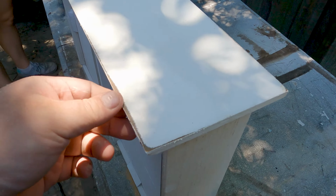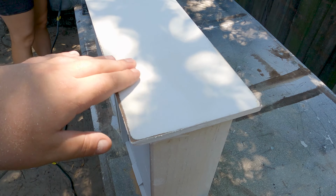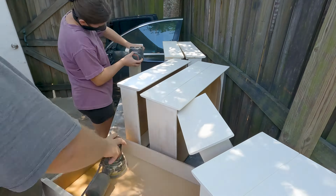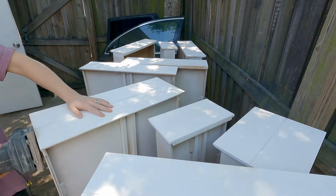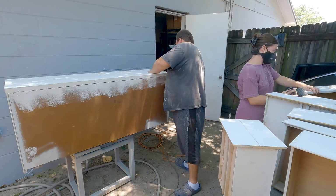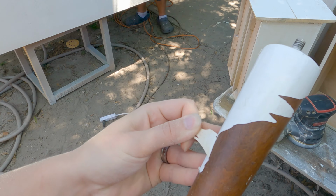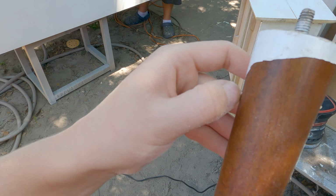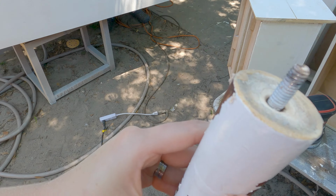Going to stain the drawers. The wood seems to be greenish and really dark, and the paint just doesn't want to come off. Turns out that whoever painted it didn't even sand the whole thing a little bit, or at least the legs, because the paint is peeling off. And underneath the legs are in great condition. If I remove the whole paint, then I won't stain them. I'll just use a restore finish or something.